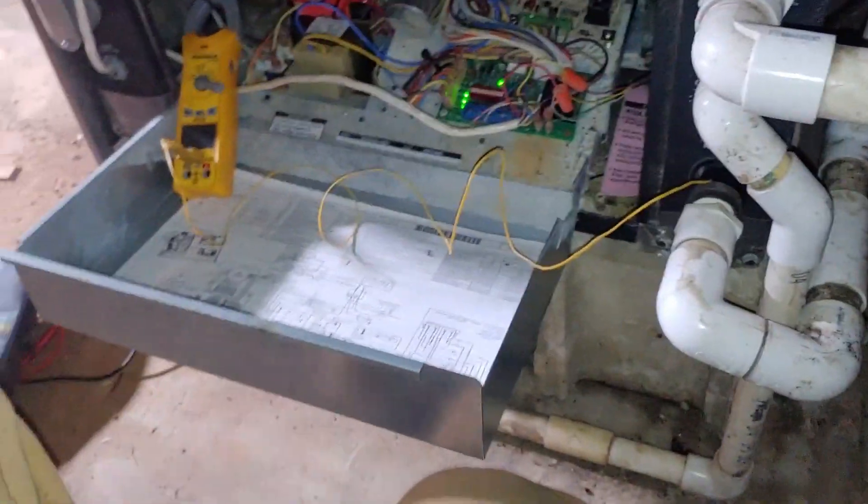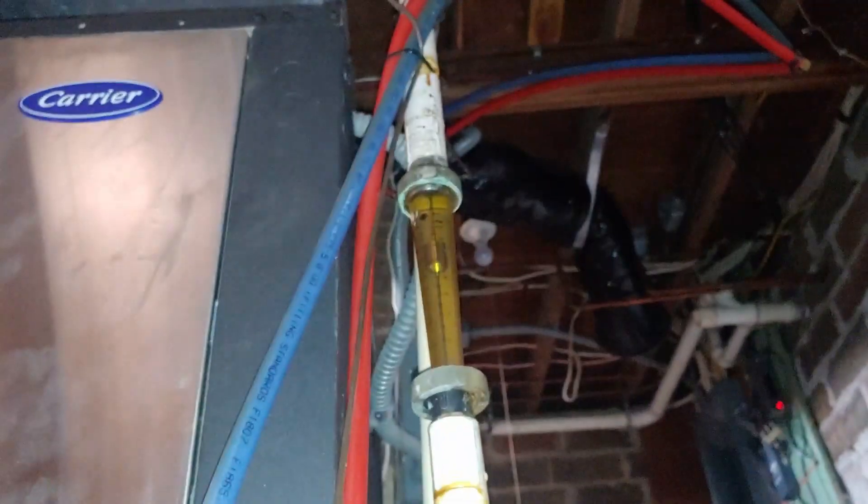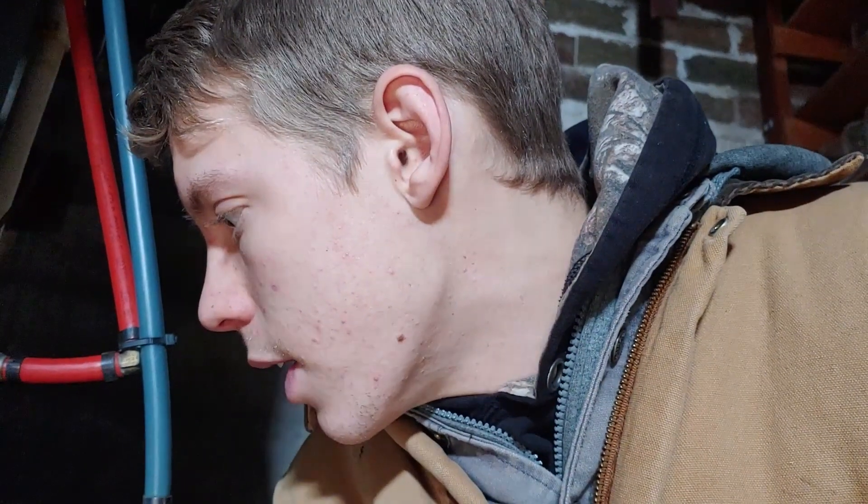So that's how you mix propylene glycol for a heat pump system. This is a unique system — the way you have to add fluid is not very user friendly. A lot of them have a valve where you can just add water in directly and watch your level on a tube. But these systems aren't really under pressure; they just have liquid in them and it just pumps the liquid through. Some of them, like this one, lose a little bit of liquid over the course of a couple of years, so you eventually end up having to add some. But I think that's gonna take care of it.